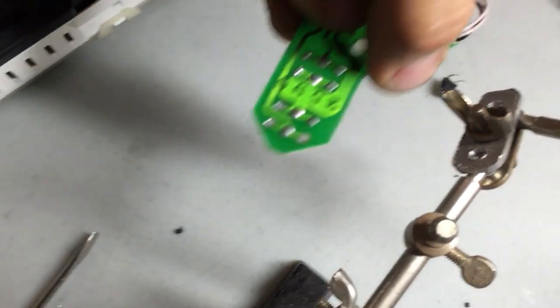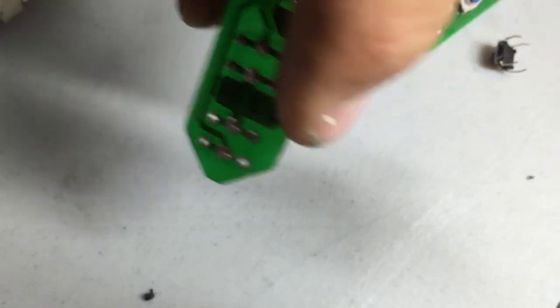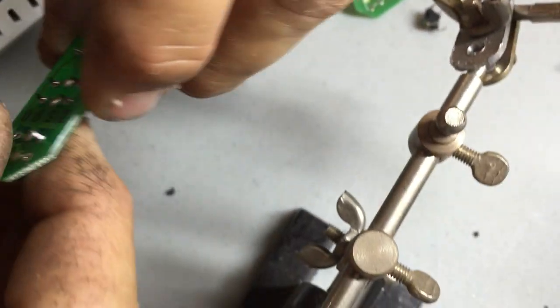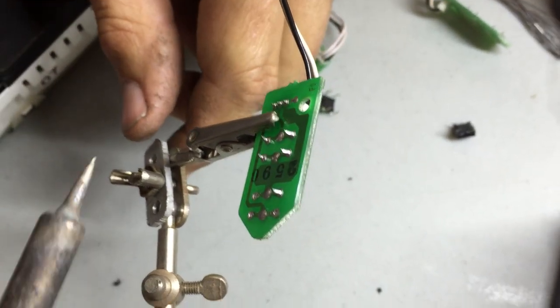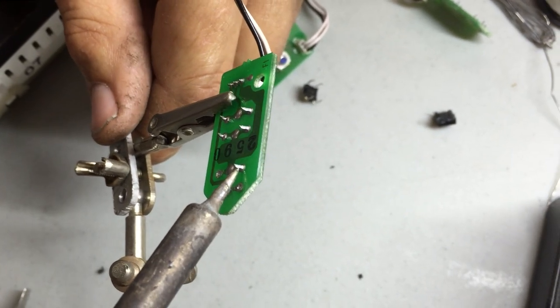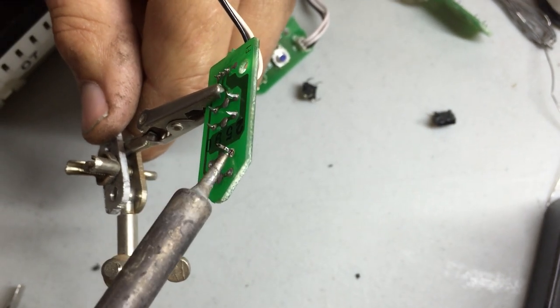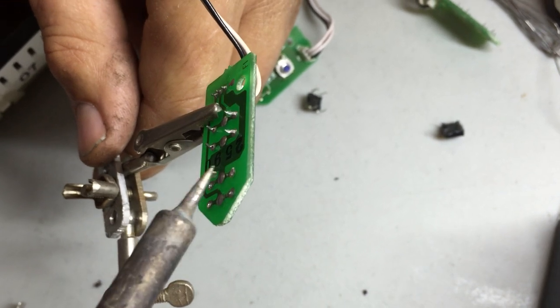I've got one here that I've already removed some of the leg. This one's already cut off, and I've removed some of it. I'm going to show you a couple ways real quick how to do this. I have a solder hold device — alligator clips on a weighted base — and my solder iron's ready to go. Sometimes you can just take this, put your solder iron on the little leg, get it hot, and the little pin comes out of there for the most part. You've got to work at it.